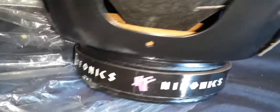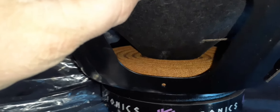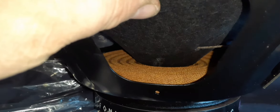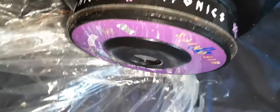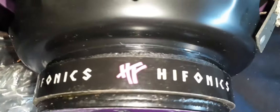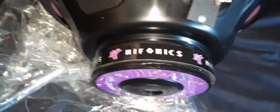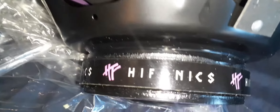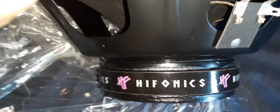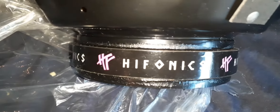You got spade terminals because, like I said, this is a real budget sub. There's just a slight sag — it should be sitting right out there but it's sitting a little bit lower. I bet if I put them upside down for a while they could probably come back. You've got a stamped steel basket and just a sticker around the magnet — it's a single slug. Looks like you've got a top plate and a bottom plate, probably the same size in diameter and thickness.